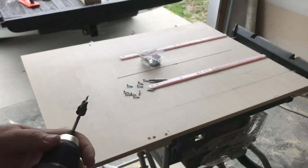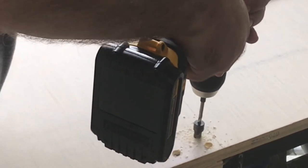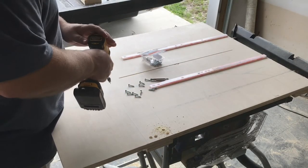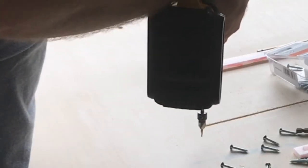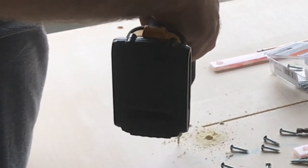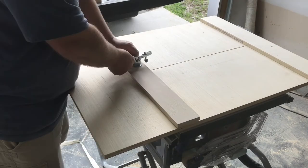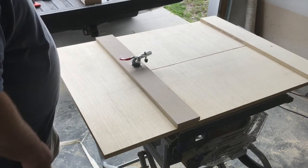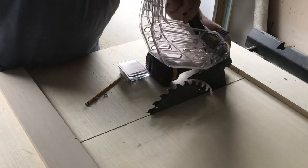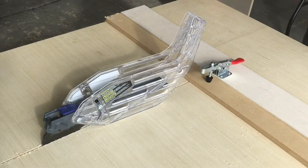After all adjustments, I turned over the sled, pre-drilled, countersunk, and screwed in several places to secure the back fence — getting close to but not intercepting the path of the saw kerf. There won't be any glue on this fence, so it's important to put enough screws to hold it over time. With both fences firmly in place, the last thing I needed was a way to secure work pieces. I got these lever clamps from Amazon — they were inexpensive, I'll put a link below. I installed the blade guard and now we're ready to cut some pieces and see how this new table saw sled works.